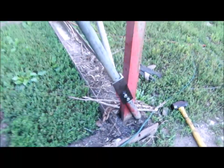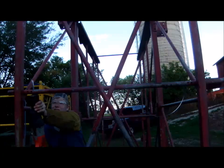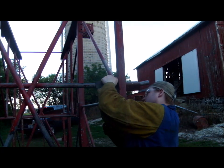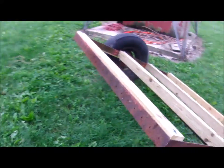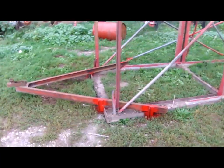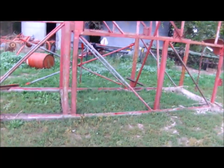Here you can see I have the other side ready to go. I need to get this X-shaped web out of the front to aid the installation of the throwing arm, so I've cut bits of angle iron, drilled two holes in them, and I'm going to weld it right there so it'll become part of the X and the whole thing can come on from the front. After drilling I can cut away the X, then simply bolt them back on and weld them to the X to make an assembly. To solve the transportation problem we found this old wagon dolly made out of angle iron with an axle in the middle. We put 4x4s across, and I welded a hitch on the front with the ball on the end. Now the dolly is going to sit somewhere about right here and the whole thing is going to become a trailer to wheel down the road.